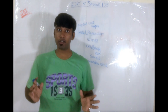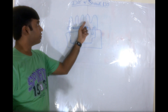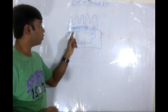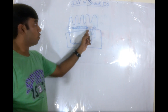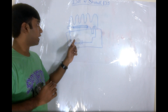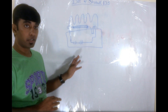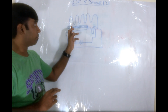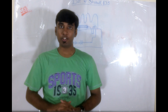So I'll just quickly show you the electrical circuit for our wire loop game. That is our wire loop game. This right here is the metal coat hanger, which is bent into whatever shape we need. This is the paper clip made into a loop or a hoop, and it is kept on top of a wooden stick. The connection from the paper clip goes to the LED above, which lights up when the game is over, and that is connected to the positive terminal of the battery. The negative terminal goes to the key and to the coat hanger. So when the key is on, the current moves from the negative terminal through the key and on to the coat hanger. When the loop touches the coat hanger, the circuit is complete. That's how we work the wire loop game.